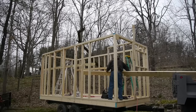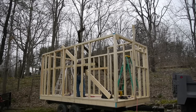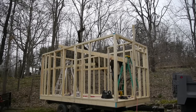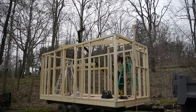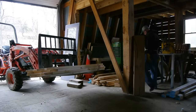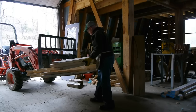Now we'll take the ridge board and stick it up in there. The ridge board is a two-by-eight — the reason it's two-by-eight is because my rafters are two-by-sixes, and you want the ridge board to be one size bigger. I've cut slots in the end boards so I can stick one end up in there, then carry the other end up the ladder and shove it into the other notch. I used a two-by-eight rather than a one-by-eight because that vaulted ceiling section — about eight feet long — needs a sturdy ridge beam to carry the weight of all the rafters plus any snow load.